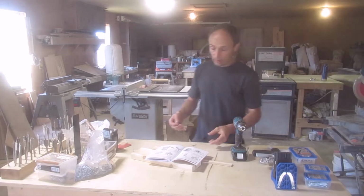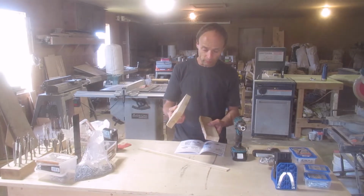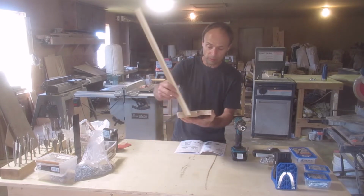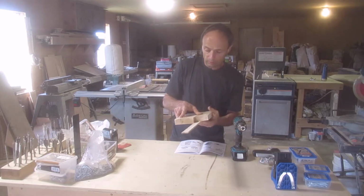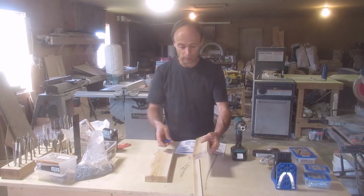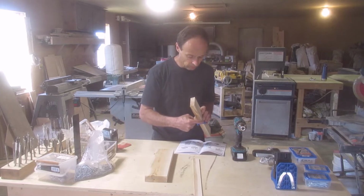Okay, and since I bought this for two dissimilar materials, 1 1/4, which is a 5/4 lumber, and a 4/4, which is a 1 inch. Okay, I have to look at this joint, putting a spacer underneath of 1/4 inch under that 1 inch material to bring it to a level height. Okay, but I have to look at this as a 1 inch piece. This just happens to be larger, but this is what the thinner piece is I'm going to be gauging my pocket hole on. So when I take my tool and I look at it, I fall into that fuzzy space.